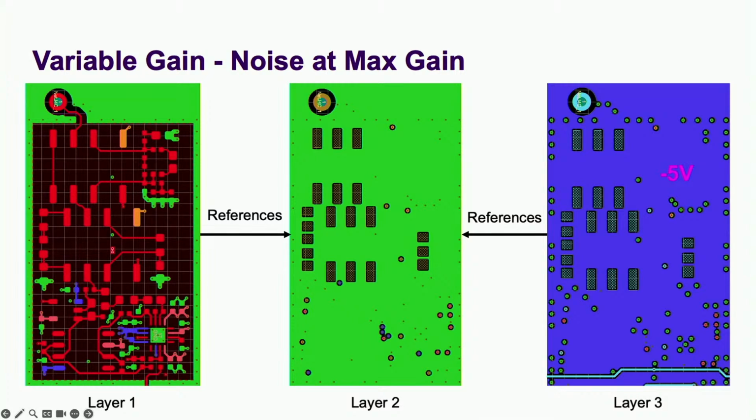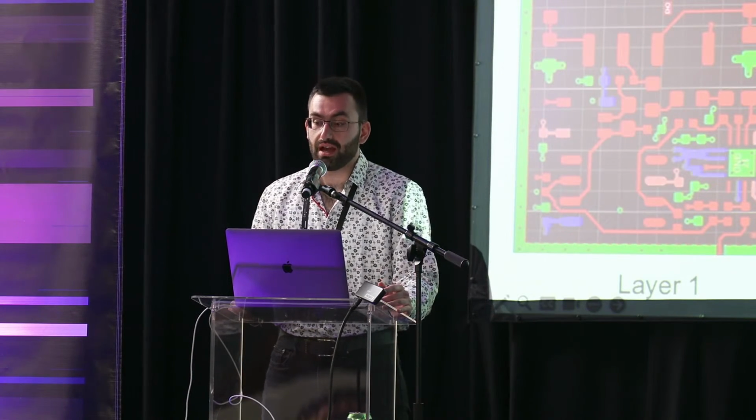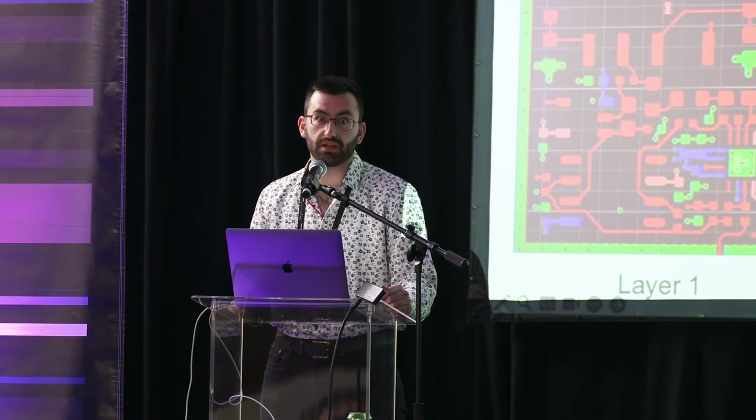The reason it only shows up in high impedance mode is that a tiny 1 nanoamp coupled current into the 1 megaohm input impedance turns into 1 millivolt, which is then gained up by 87 times, and that's a huge problem. While in 50 ohm mode, it would become only 50 nanovolts. This is still just a theory, but I will be moving the power plane to a different layer next rev, so we'll see if it's correct soon enough.